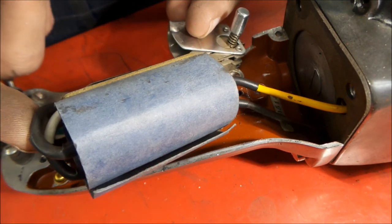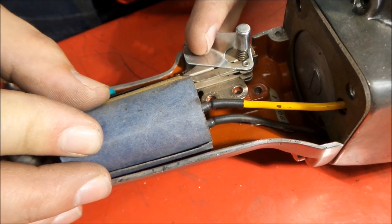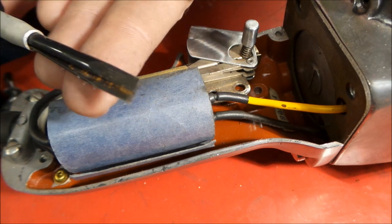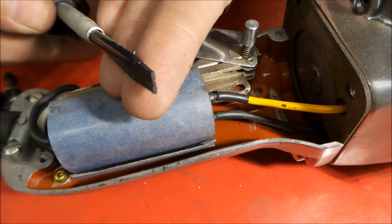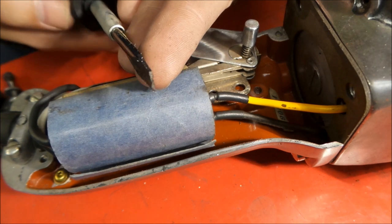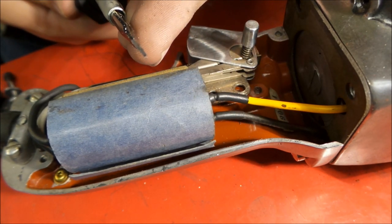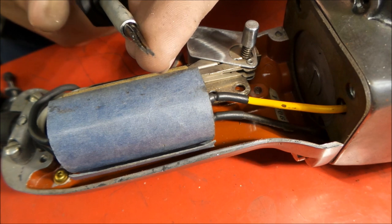Okay, so we got our switch wired in, a little hard to see, but we got our cables all stacked here that they fall down inside. Gotta get our two screws in. And you know, the plight always with these flathead screws is, how do you get them started? Well, we're gonna use a holding screwdriver, which basically is two wedges that are on an angle. I don't know if you can see that or not. There you go. And when you slide this collar up the wedge, you can see it's splayed out there, it expands how those sit, and it tightens on the fastener.